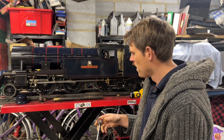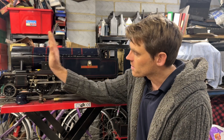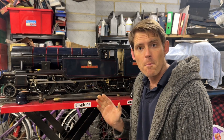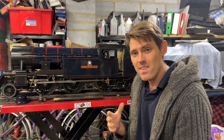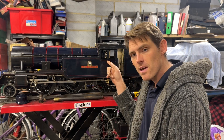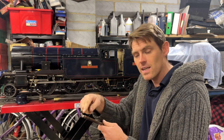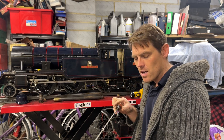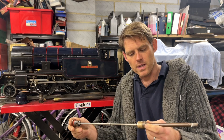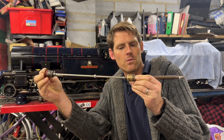So why was it leaking? Well, the backhead and the tube plate are not perfectly parallel — they're probably pretty close, but they're also not perfectly in line. Again, they're reasonably close, but you can tell when the regulator gets put in and bolted up at this end, this end is not in the middle of the bush at the front — it's just kicking down slightly. What does that mean? Well, it means that all of this isn't sitting square.